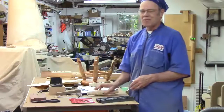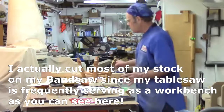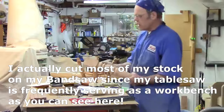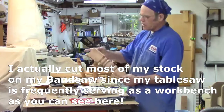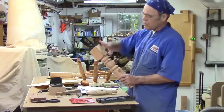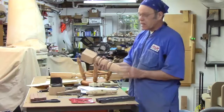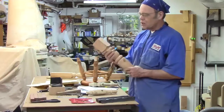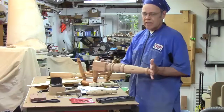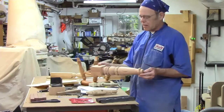It's generally pretty rough sawing on the table saw. We're not going to get into pommel cuts as we talk about spindles today. That's that cut you have on a chair leg or a table leg, possibly, where you have flat areas for an apron. But suffice it to say, use straight stock, use milled lumber. Always cut your blanks to the exact length. It's just an extra operation. You have to come back and cut it later.